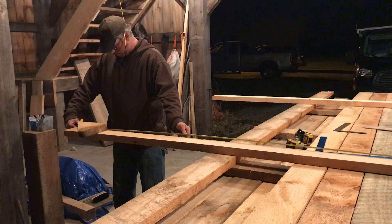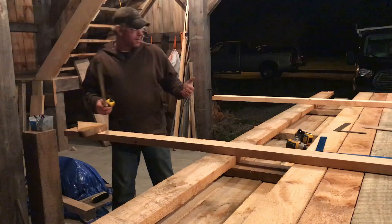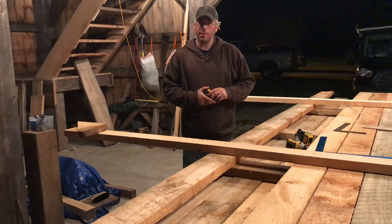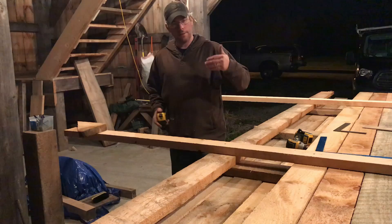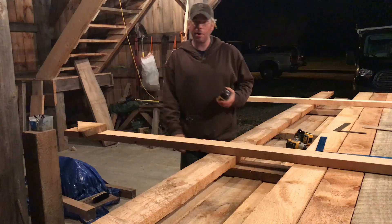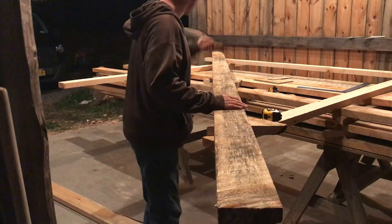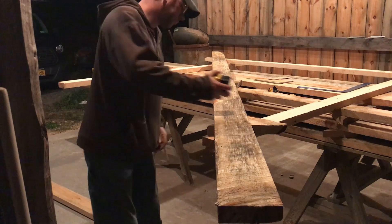Right-hand triangle — I want 83 and 5/8 inches and we have that, beautiful. Now I'm going to take my straightest rafter stock. I want the straightest piece that's easy for me to get to on top of this pile of rafter stock to do my template. I don't want a big crown and I don't want a big bow — I want this thing to sit flat. I selected a couple to choose from and I'll pick the best one. This is going to be my rafter tail up here and the top of the rafter over there, so I want to make sure I have it where I want it.